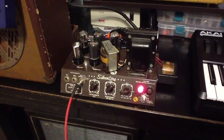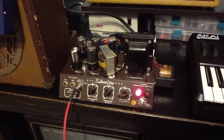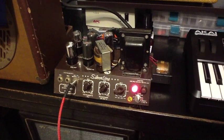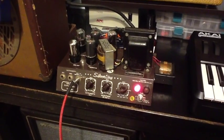This is a demo of a rebuilt Silvertone 1300. The original amp was in a combo form with the output transformer mounted to the speaker, and the choke was actually the field coil of the speaker. I have mounted an output transformer directly to the chassis as well as a 10 Henry choke on the side.